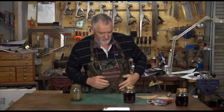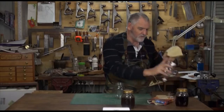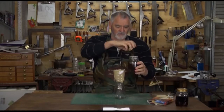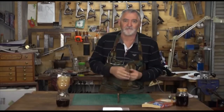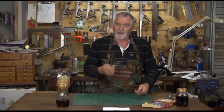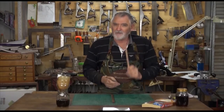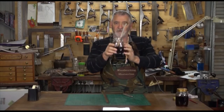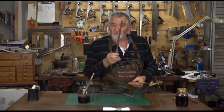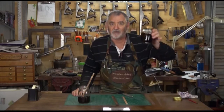What I've got here with the tea will also filter out — coffee filter, soft drink funnel, pop it in there. Take the top off the tea — it looks disgusting. What I've done is cut up a couple of pieces of maple — Queensland maple — and a piece of myrtle. Now I know myrtle has heavy tannin in it so it'll darken quite nicely. Maple I don't think has much tannin in it. I've got two sticks of maple: one I've marked 'tea' and I've just put that into the cold tea. I'll leave it there for a couple of hours and then I'll put the myrtle, the untreated maple, and the maple that's been in the tea into the ebonising solution and leave it overnight.